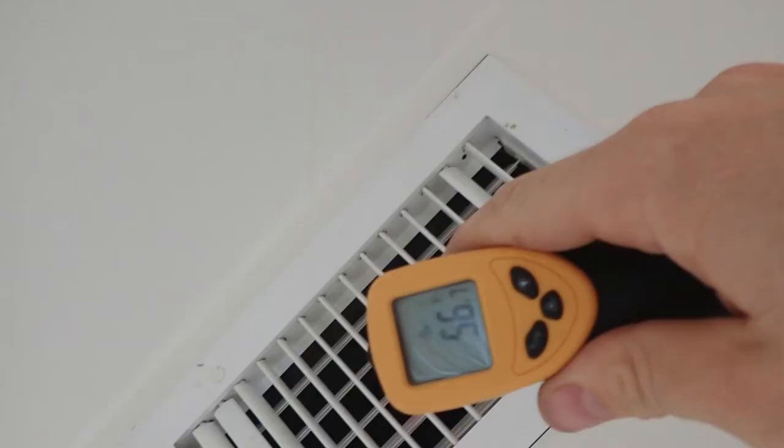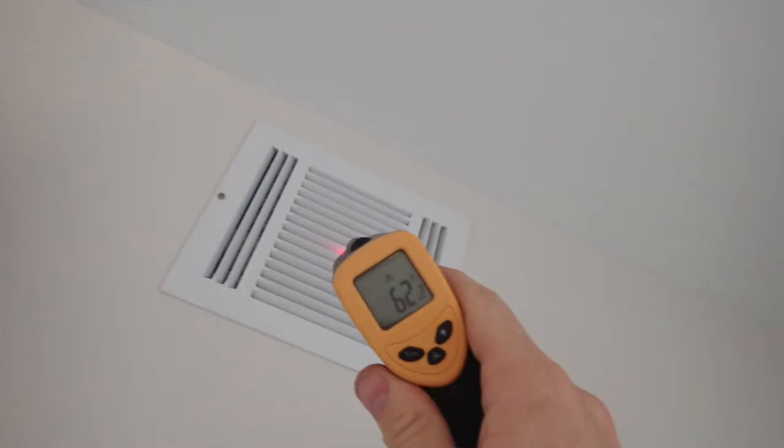This next find is going to be a little difficult to show on camera, so I'll talk about it. Whenever I walk through a house I like to use an infrared thermometer and hit all the registers. I noticed when I was in the kitchen it was about 10 degrees higher. So we know we need an HVAC technician to come in, because that side of the house won't be cooled properly at all. I actually have one more find to show you outside.